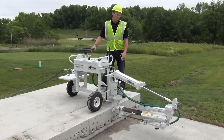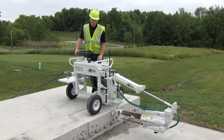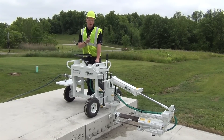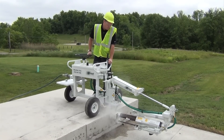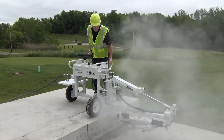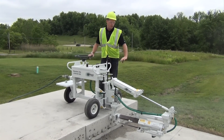Now that our drill is in position and we've set the drill depth and height, we're ready to actually start drilling. We want to turn the drill on and then we need to turn our feed on and it will automatically come in. Once it reaches the desired depth, we can send it back out by turning the feed back out. When you turn the feed back to the off position, once the drill reaches the back end of the rail, it will stop automatically.